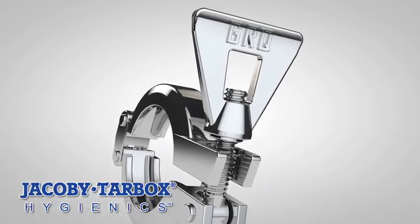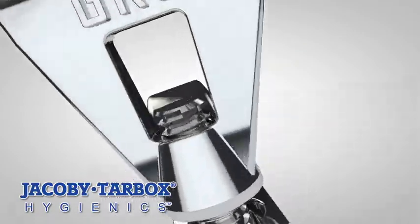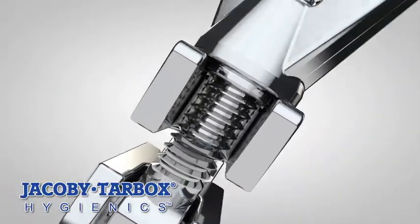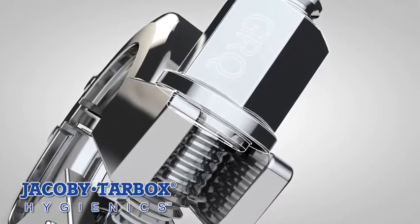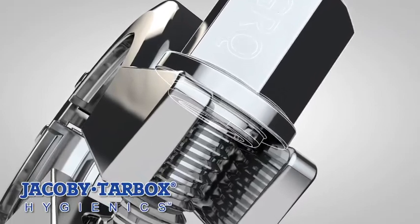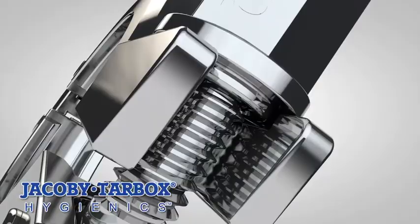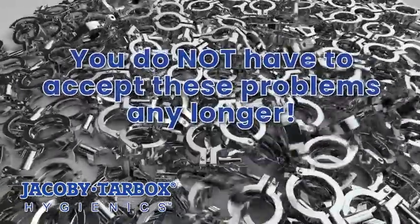The nut design is often overlooked as an essential element of a successful hygienic clamp. The pocket in the fork captures the boss of the nut to ensure perfect alignment and easy assembly, while the flat nut seat maximizes the amount of force transferred from each rotation, minimizing the torque needed to create a seal and maximizing gasket life.